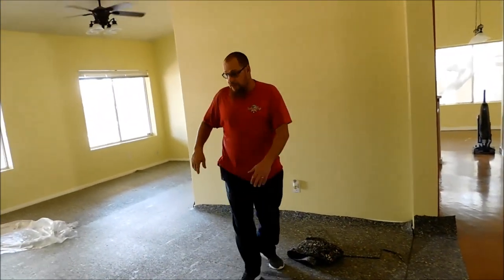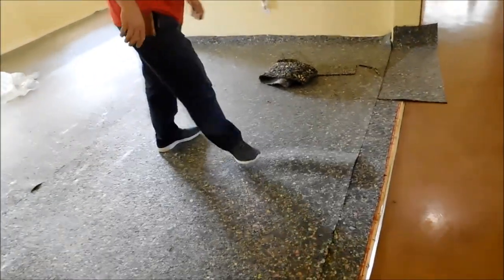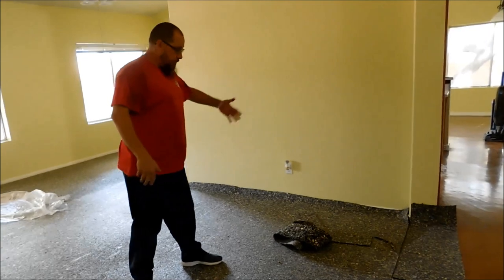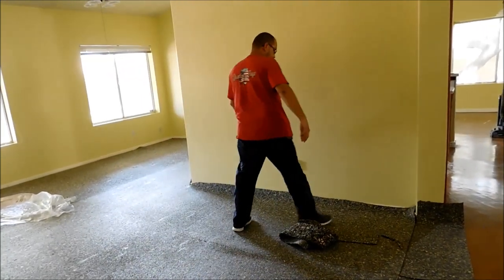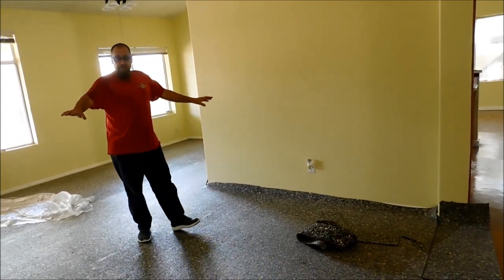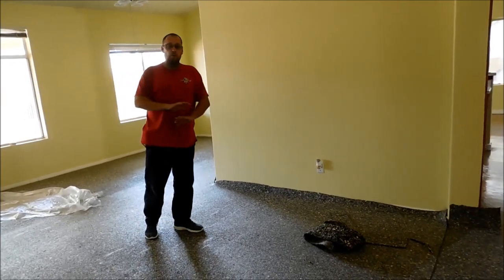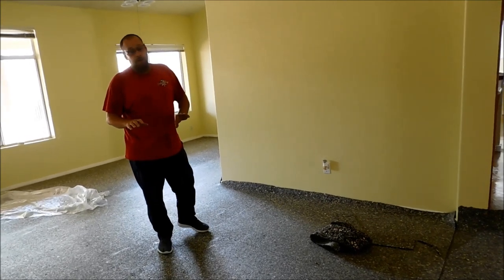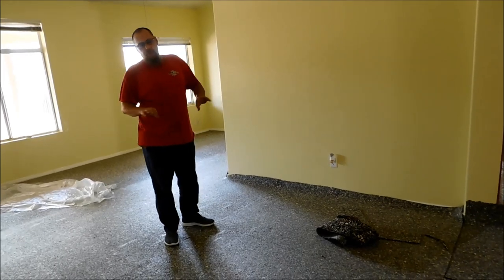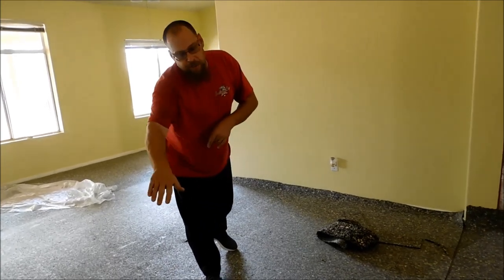It only takes a second before you do your cuts. Just bump it a little bit toward the center from one end, bump it that way, come the other end, bump it that way with your feet. If you'll just stretch it toward the center and then make your cuts, if it does anything, it's just going to push a little tighter to the tack strip if you do happen to cut it a little short. So it's win-win no matter what. Just scrunch your pad up, compress it together before you make your cuts, and you're always going to have it nice and tight up next to the tack strip. You'll have no ridge right there at the edge.